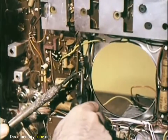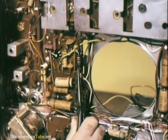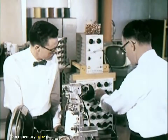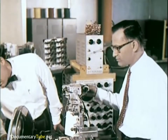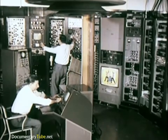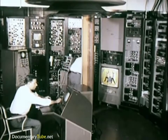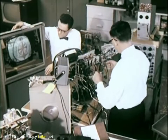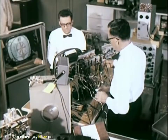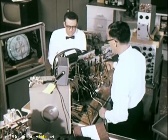In the mechanical laboratory, the chassis prototype is assembled with all of its component parts. Once the chassis is assembled, it is sent into an electrical laboratory where engineers make elaborate tests to check out all its circuitry, aided by test pictures and patterns originating from Cherry Hill Laboratories. It operates much the same as any television station. However, by using a closed circuit, engineers can simulate conditions such as distance, and can also create their own interference so that they can be sure that a quality picture will be produced even under adverse conditions.